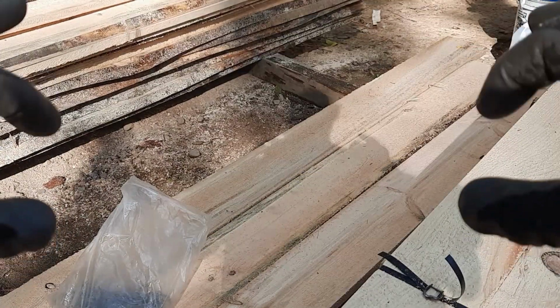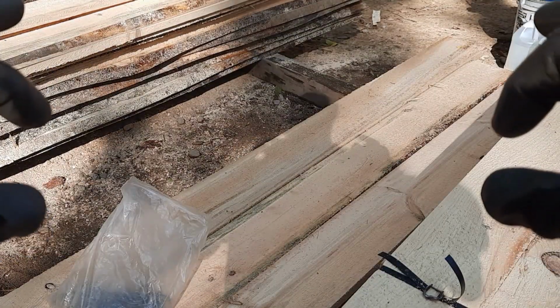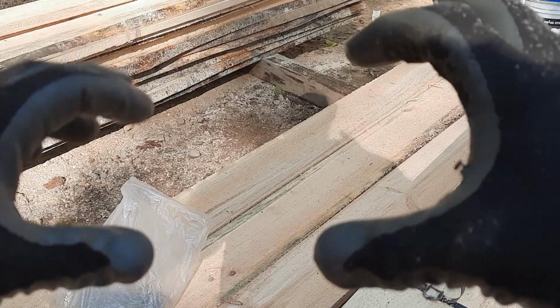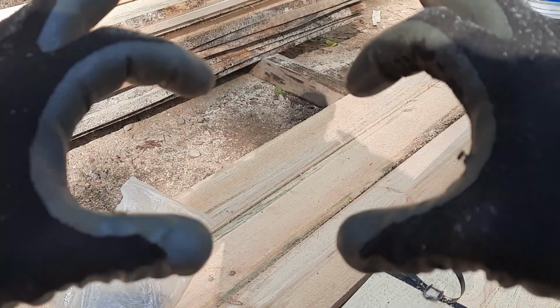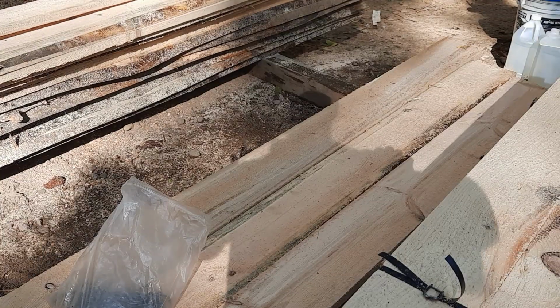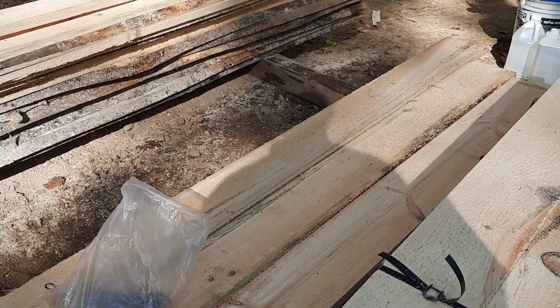So I'm squeezing the 2 ends in the middle, hoping to keep the whole stack straight. If you squeeze just the ends, it could potentially cause the middle to bow out. Also, the stickers will be loose in the middle of the stack when you do that. And if you only squeeze in the middle or just 2 in the center, you could have the ends bowing out, loosening the stickers on the ends, so the stickers will fall out, and also the wood will end up drying all bowed like that, which you want to avoid.